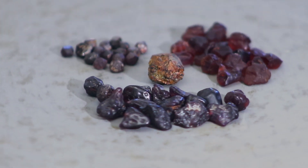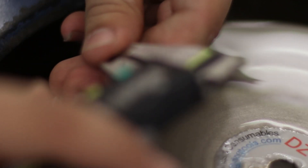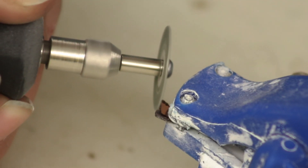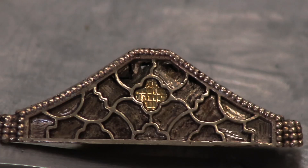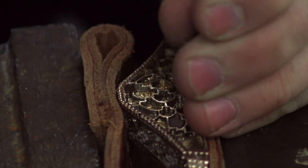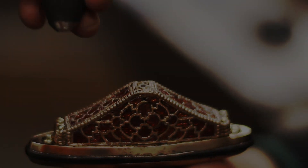For decoration of the pommel, Black Hills garnets found by the team, along with some from India, were selected. These garnets were ground to slabs and polished. Each garnet slab and a gold-plated waffle foil was then cut to fit the cells of the pommel. Once the pieces were inserted, the bronze walls were peened using a punch and hammer. The pommel was secured, completing the sword.